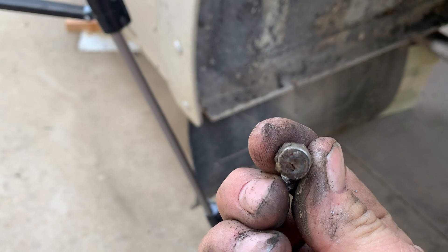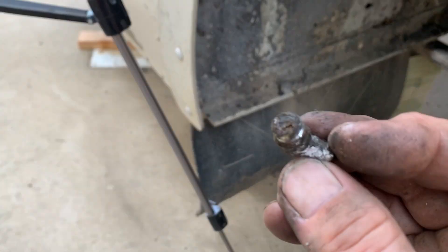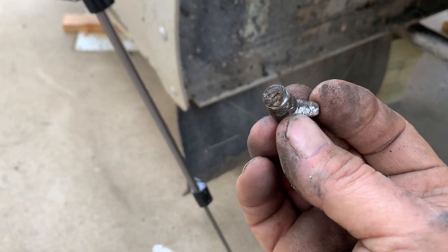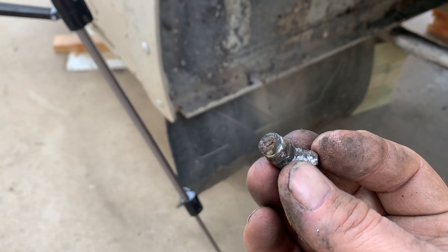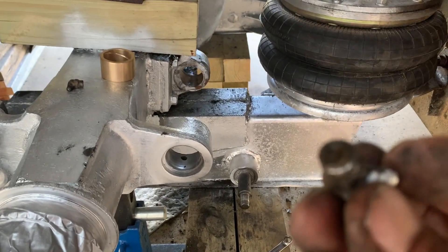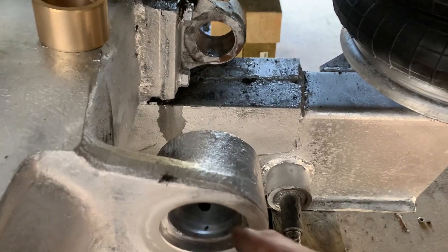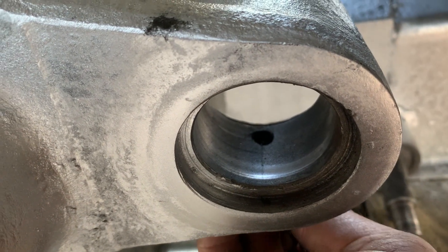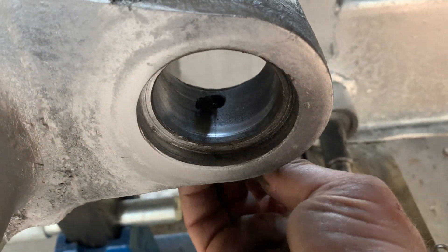Come on camera, focus. There you have it — look at that. It's going to push through; you can't hardly stop grease as long as the zerk is good. It'll push that old nasty stuff right into your new bushings. So go that extra step, take a little extra time, don't get in a hurry. Clean out your grease zerks or plug holes like this. This one right here is plugged — let's see what pops out of that sucker. Coming in from the bottom side so you guys can see — just old nasty grease.